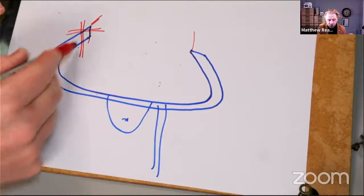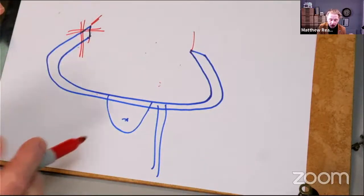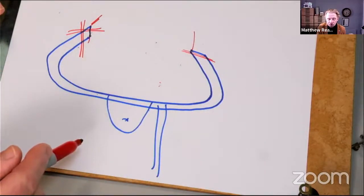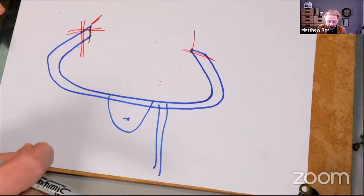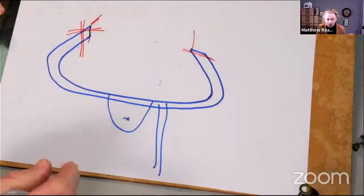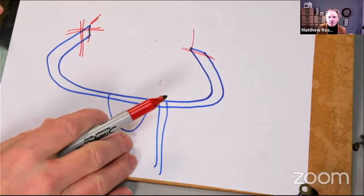is I'm going to file this back until we've got a 45 degree impulse face there. And I might also file this back a little bit in order to square up that side, on the basis that it's soft enough that I can file it. Of course, the trouble is if you file these things back, as has already happened here, you've got no impulse because the pallets are effectively too far away from the wheel.